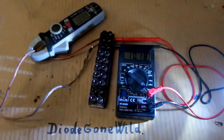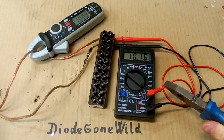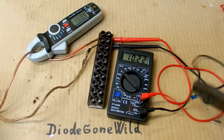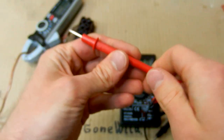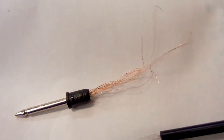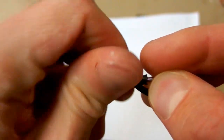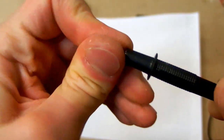Can you see the smoke? It's completely liquid — when I press it, it stays pressed and it sticks to itself. So that's 10 amps — it's nicely molten, and of course the connector just comes out. The cables could be soldered back, but it's better to buy some better probes or a better multimeter. You can also just twist it together — and it's fixed for my high voltage test, of course.